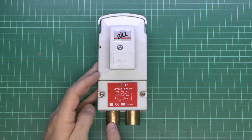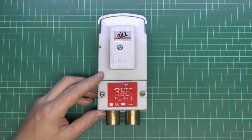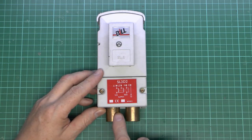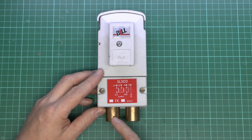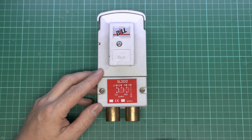What we've got here is the cables actually come in the bottom — this is for the supply, so basically a cable would come into the bottom of the lighting column. It's got two of these because the supply wires would come in and then go out again, looping along the street to the next one and so on, all the way down the road. So two of these is fairly common.